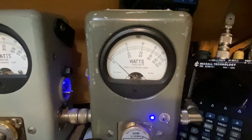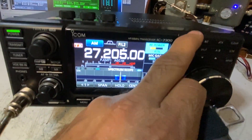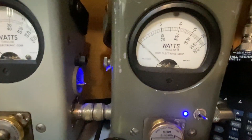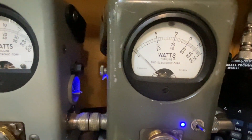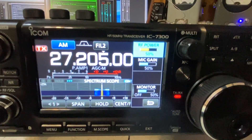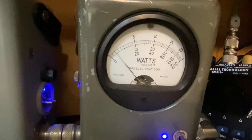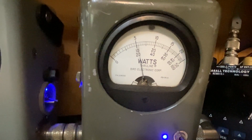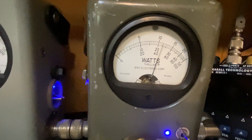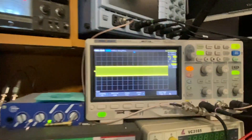If you want less than 1 watt, you can bring it down using the main RF power control on the radio — anything between 0 and 1 watt. But it's recommended to run it at 50% RF power. Let's start off at 1 watt and go up as needed, up to around 25 watts. They're almost maxed out on the carrier control.